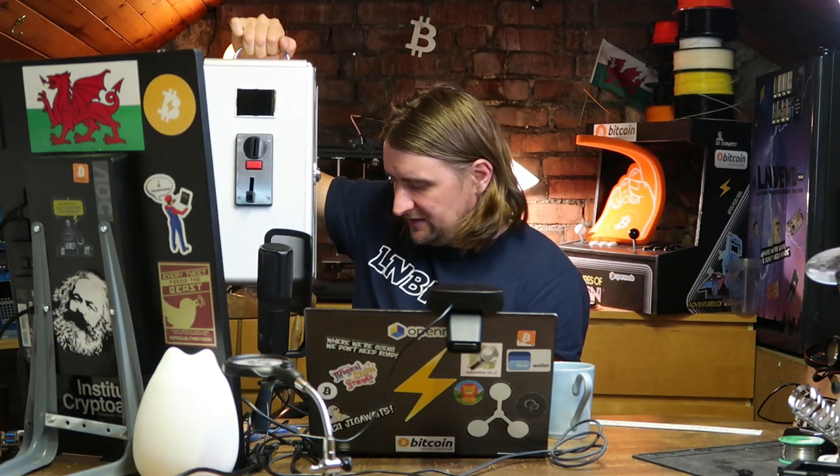I'm really stoked that I finally found a coin mech which works. It's a little bit more expensive — the cheaper one is like £20 and this is £40 — but it's honestly worth its weight in gold. The way this communicates is it actually sends a number to our ESP32, so we're not relying on those weird little pulses.